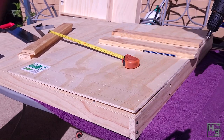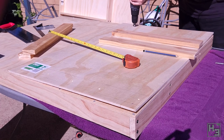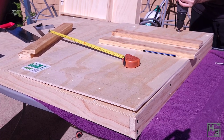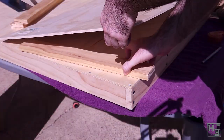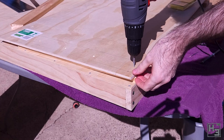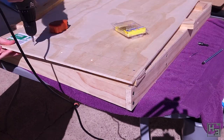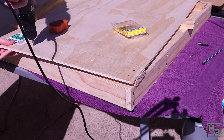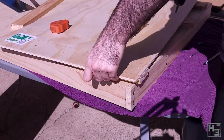I wanted the pine pieces about 25mm in from the edge so that the outer edges of the frame wouldn't interfere with the bolts that will come later. I did make countersink holes for the screws here, which are the same as I previously used to screw the plywood to the frames. And then, unsurprisingly, I drive those in. I didn't bother drilling pilot holes for these — it probably isn't super necessary. And that's the vertical bracings in place.